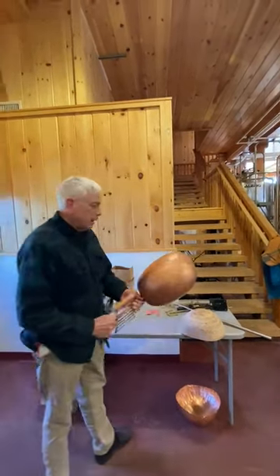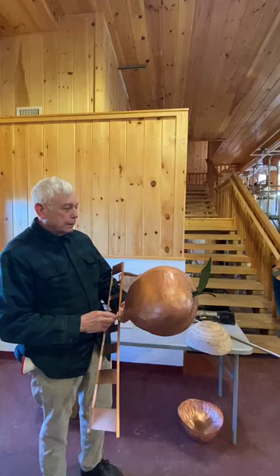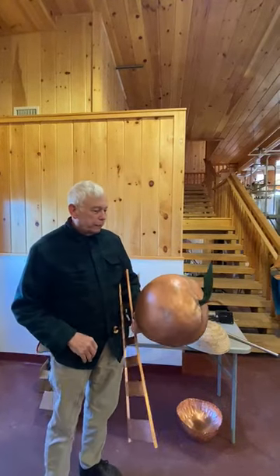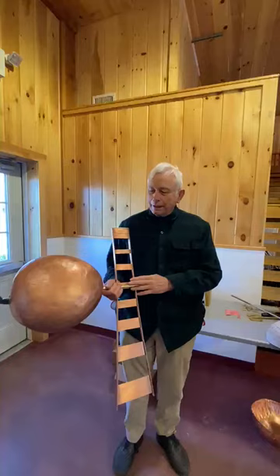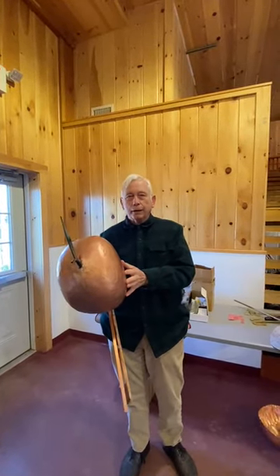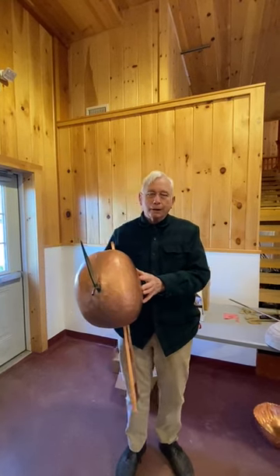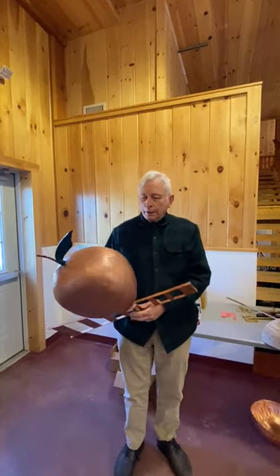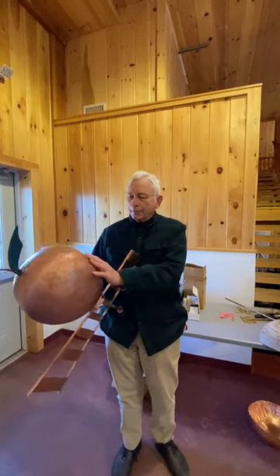To make the apple, I started with a flat sheet of copper. Believe it or not, if you pound on a sheet of copper long enough, you can get it to take almost any shape. But you have to keep annealing it — when you pound on it, it gets hard, then you anneal it to make it soft, then you pound on it again, it gets hard. So maybe after a hundred cycles of that, I finally got the first half done.